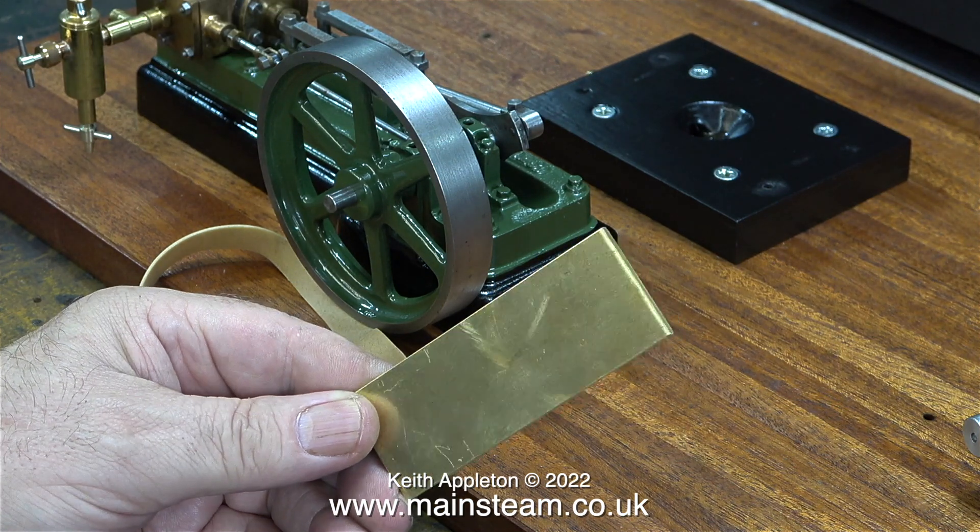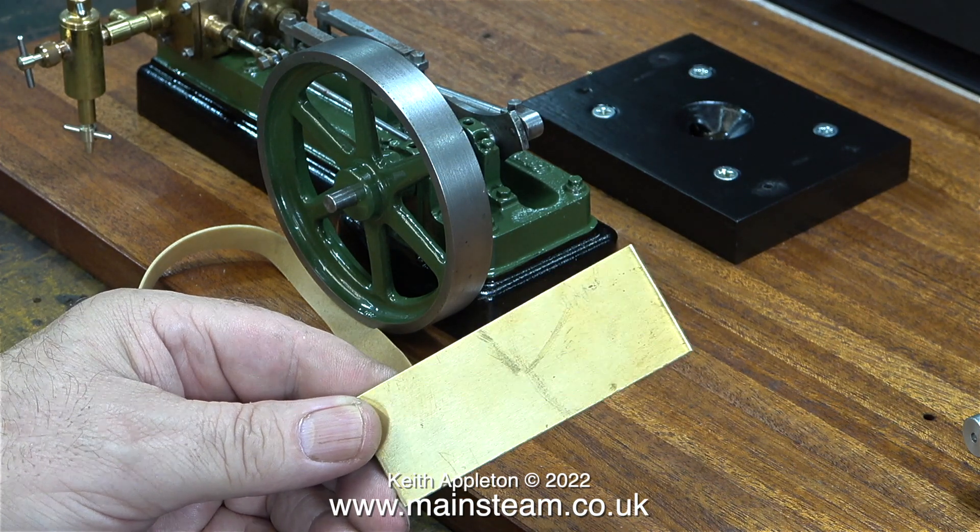I do not have the design as I want it just yet. I think I need to make another plate to mount the dynamo on, and then that plate can slide on this plate with adjusters at each end. One viewer wrote in and suggested that I could mount the dynamo so it would swing back and forth to tension the belt, but I didn't like that idea. Once I figure out what I'm going to do, I'll make a video about it.